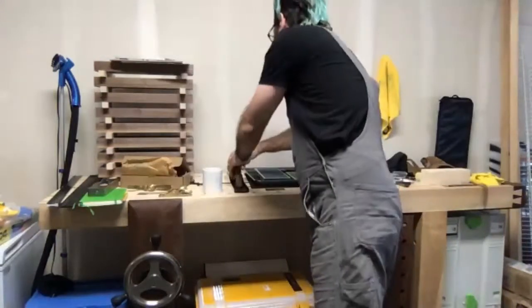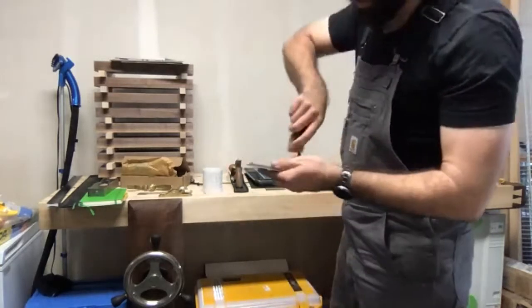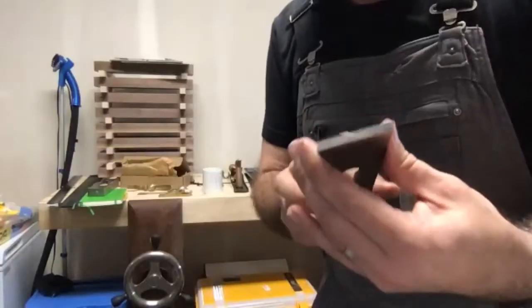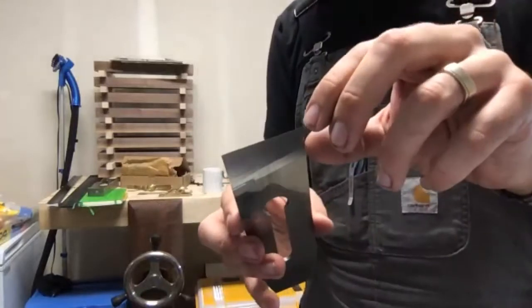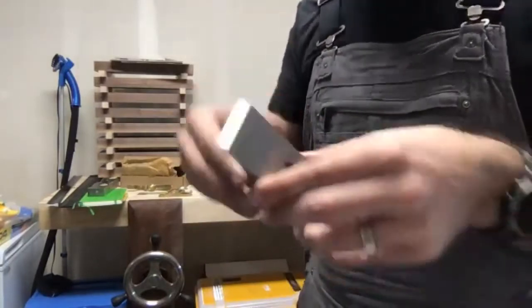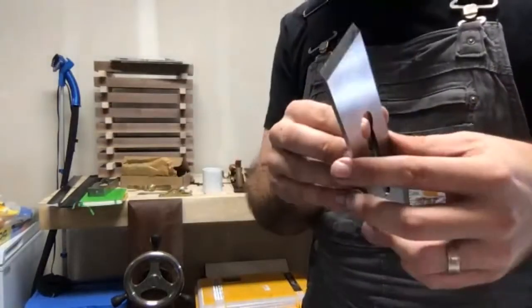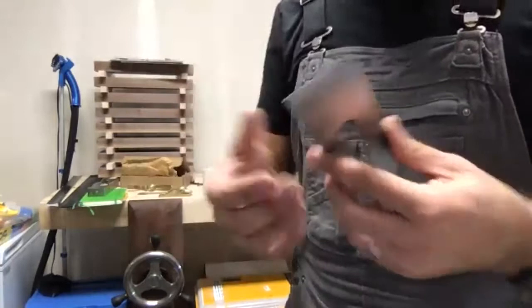To contrast that, I have on my jack plane, here. Whoa. Right? That's the back half of the blade. And I probably polished way further than I needed to. You really only need the top half inch or so done. But as you continue sharpening, this iron is going to get shorter and shorter because you're going to be removing material. And at some point, the sharpened bit will intersect with these bits down here. I just didn't have to get it that far already.